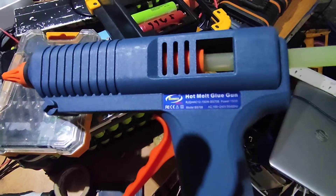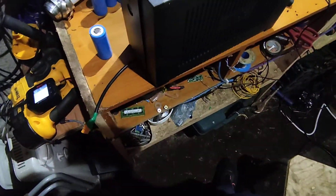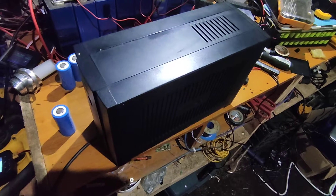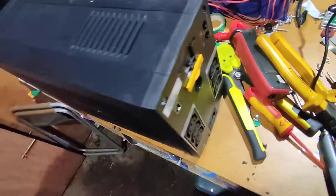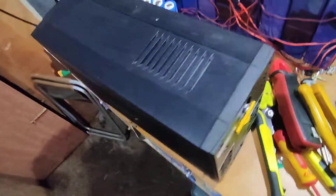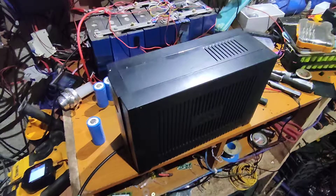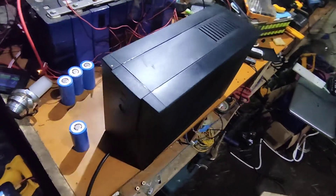I had the glue gun running on it and that was 150 watts, pulling around 12 amps - and it was fine. So I'd say this inverter in this unit is not bad. It can probably do a little bit more - I saw two 40-amp fuses inside which leads me to believe it can handle a nice peak current. Anyway, if you like this video please give it a like and subscribe - thanks.